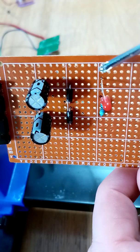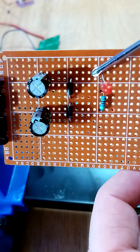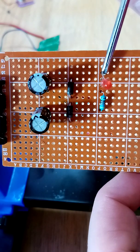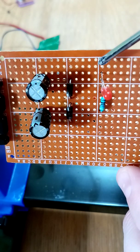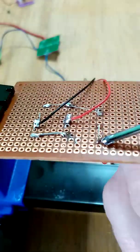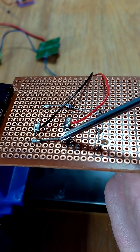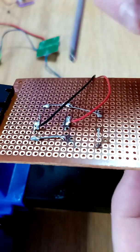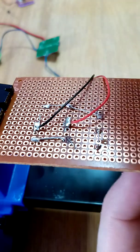The last bit now — I forgot the name of it, my mind's gone blank. The metal prong from the LED on the other side — you haven't soldered it onto anything yet — so you want to put this piece here onto this point here, from here to there, like what we did on this side. You want to do the same to that prong there.